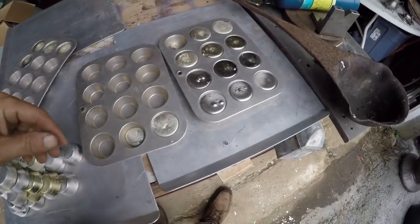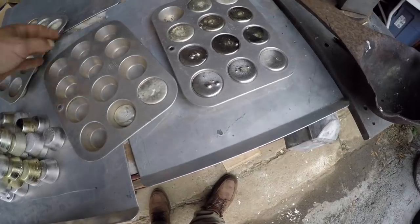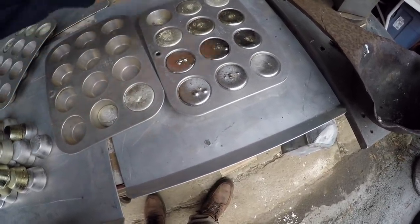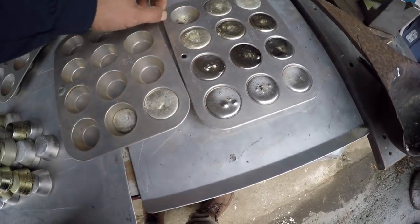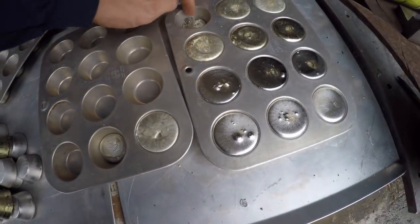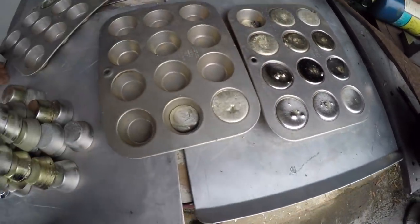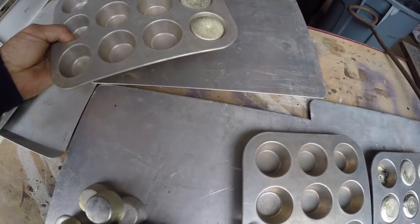So we finished pouring this. Sorry if the time lapse was kind of long. We got 12 ingots, so that's probably 5 pounds of pewter on these trays. I got 2 half pours. This one right there, it's still a little warm, but it's got slag, so that's why we stopped pouring there and we went to the next tray. The other one, it's cool enough now.